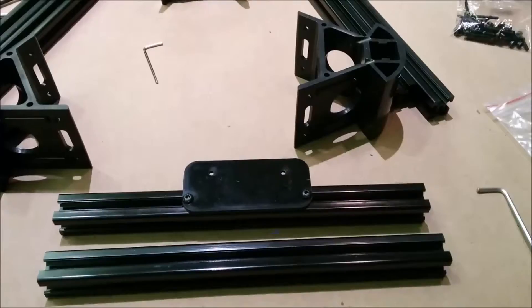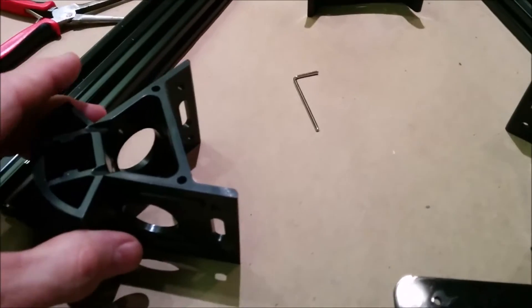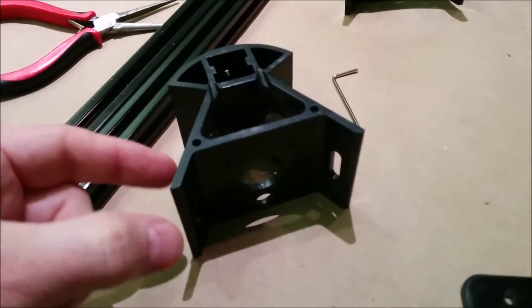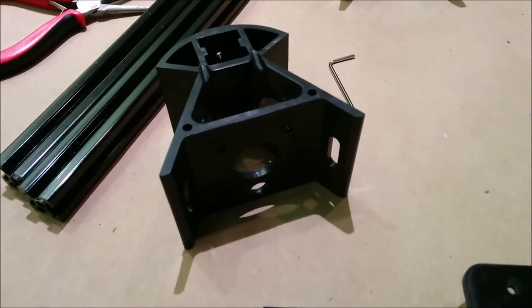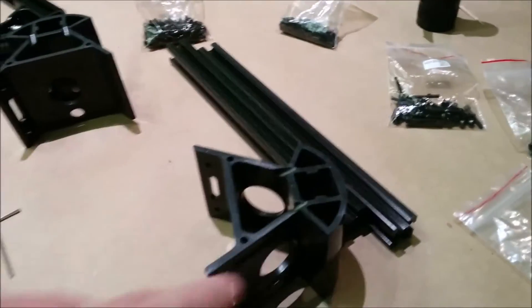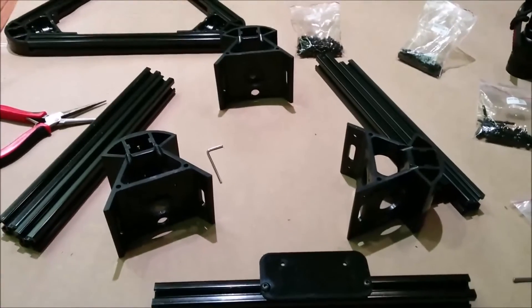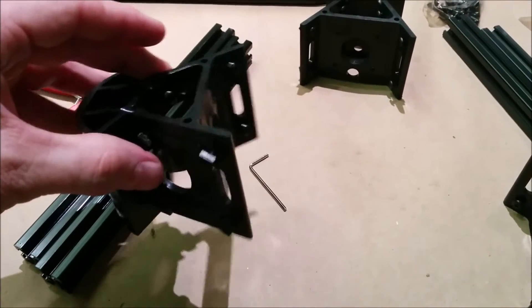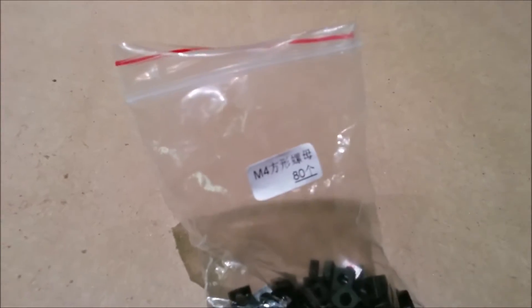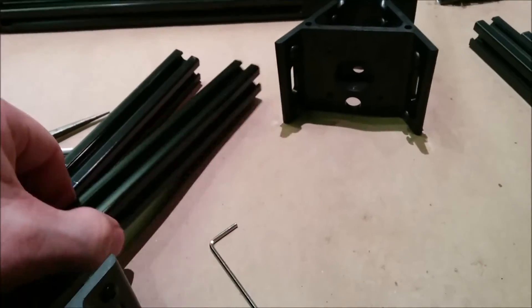I have the screws on it and it will slide in this way. It calls for it to be in the center and then tighten down. I completed that piece, got all my open beam short open beams out to finish this. That's the bottom. I'm going to go ahead and load screws and nuts — screws come in from the inside, go to the outside, and the nuts will be on this side, then the beams slide in. All the nuts and bolts are in; the nuts are to the outside. The nuts were M4 and the bolts were M4-10s.